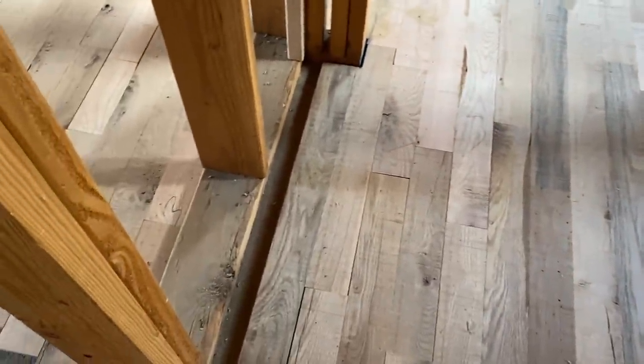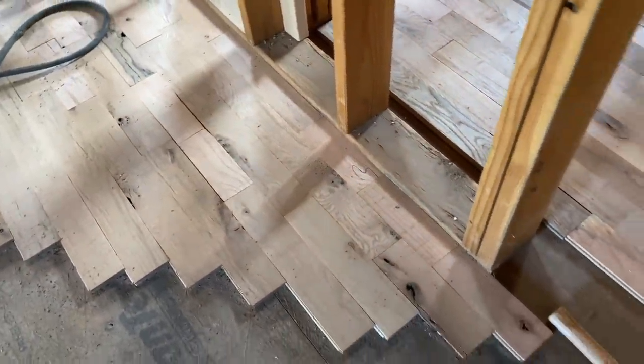We're continuing working on flooring in the first floor of the house. We've got some weird transition steps going to help me with, and finishing up plumbing and getting the mudroom floor put in. Transitions is an inch and a half between one room to the next room where the boards don't line up because we've got 2x4 walls and 2x6 walls, and it's a thing. Also, I'm not super great at putting it in, but we'll take you along, show you what we've got done so far and how to fix mistakes you make.